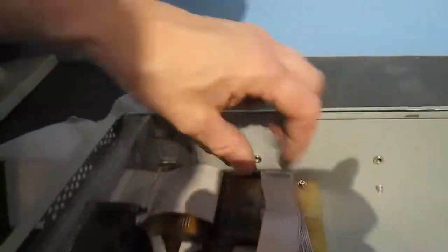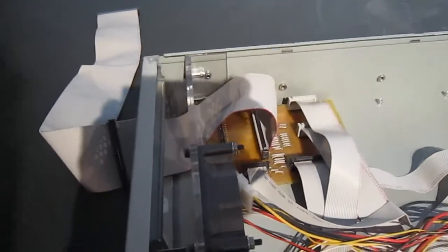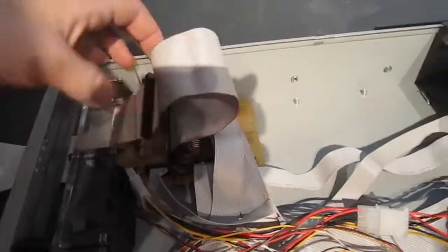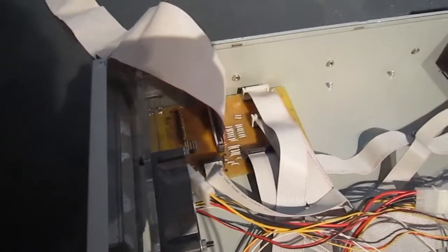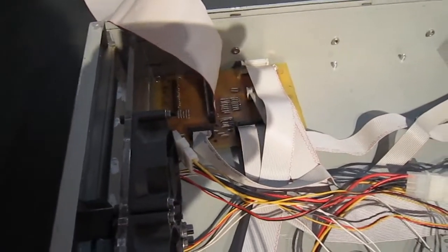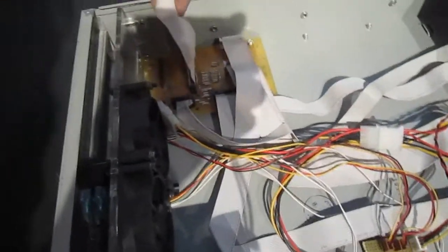And there's a power breakout board. And then that goes into our custom board that we made up to go from the 50-pin connector into your MFM drives. The MFM drive controller, in theory, can run 4 MFM drives, but we only really saw good documentation on how to get 2 working, so there are 2. And then there's a hookup for one of the floppy controllers, but I don't think we're going to be using those.